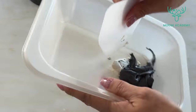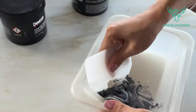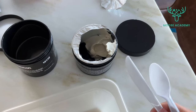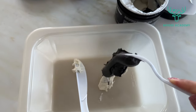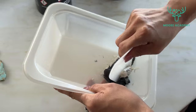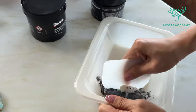Now let's talk about mixing — it's all about that perfect blend. The magic ratio is 9 to 1 by weight or 2.5 to 1 by volume for resin to hardener. You can certainly just visualize the volume, and even if you mix with a 2 to 1 ratio it would still work. Grab a mixing bowl, a spatula, or a picnic spoon. In this video we're using plastic picnic spoons and knives along with the mixing tool that came with your Devcon. For best results, the product should be kept, mixed, and applied at room temperature. Mix for at least 3 to 5 minutes so the material blends well.